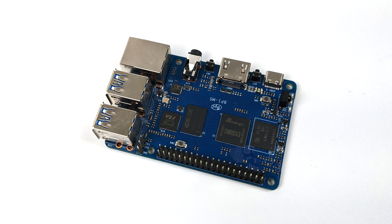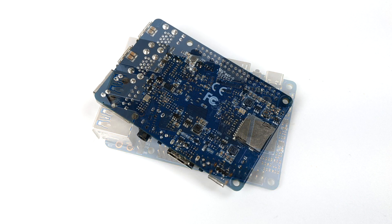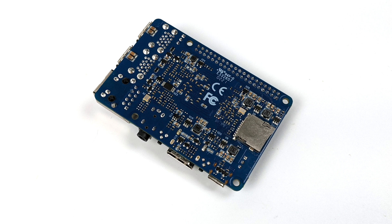As you can see, all the components are laid out on top. As of late, I've seen a lot of single board computers come to market where the CPU is located on the bottom of the board, and it does make it a bit awkward to come up with a case or even just situate it on a desk without one. This does support a microSD card, but like I mentioned, it has onboard storage — 16GB of eMMC — and you can install basically any operating system they're offering on their website to that eMMC storage, or you can boot from the SD. For this video, I'm going to be running everything from that eMMC storage because it's going to be much faster.